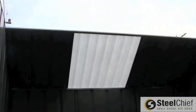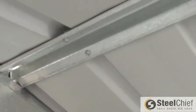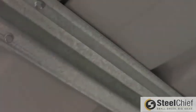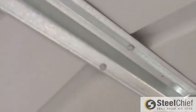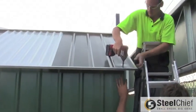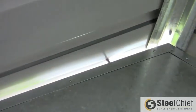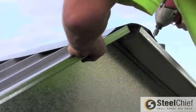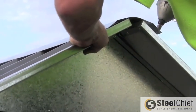Install the second roof panel. Slide it in between the cap and beam, ensuring it is fully in position. Hold it in place and screw into the underside of the ridge beam, adjacent to the screws for the first roof panel. Once it is held in position, repeat the process of drilling through the roof into the gables underneath. Finally, drill into the corners of the ridge cap from above, into the channels of the roof panels.